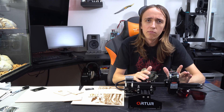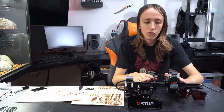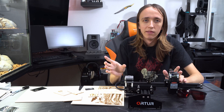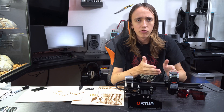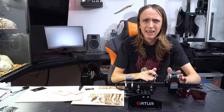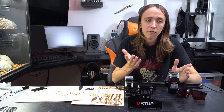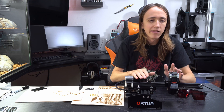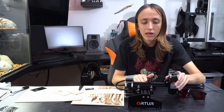The actual laser power is more like four and a half watts. So you have to keep that in mind if you compare this to other Chinese laser attachments that might say four and a half watts — you might think this has three times as much power and must cut three times as fast, but they may actually be the same thing. You can call it false advertising, optimistic advertising, or whatever. Just something to keep in mind.